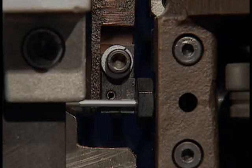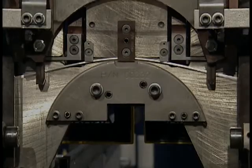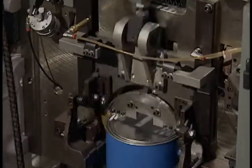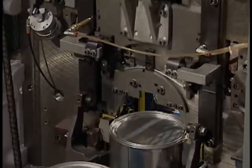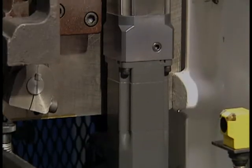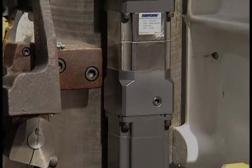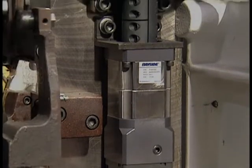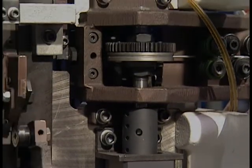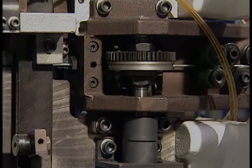At the proper time, the servo drive feeds the exact length of wire across the wire groove. It is then cut, transferred forward, and formed into the shape of the handle. The reliable consistency of this servo wire feed is one of the key improvements of the Heisler Model DS Bale-O-Matic. Precise wire length is obtained by the servo with constant pressure feed rollers, eliminating the wire check or anti-backlash assembly and greatly reducing wear of moving parts in the wire feed.